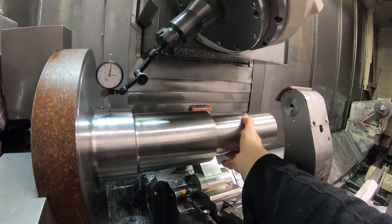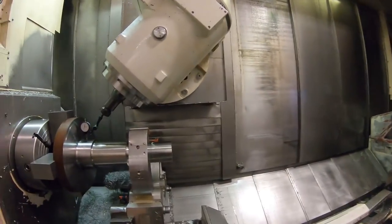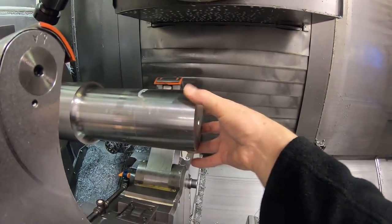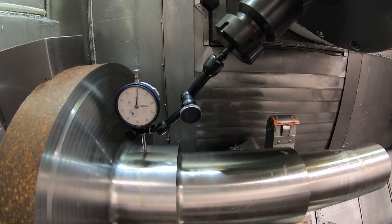And then I close the steady rest on the diameter because I have like an eighth of an inch. I don't know where my calipers are, but this comes down to four inches and it's already got like four and a quarter. I've got an eighth of an inch of material all the way down here to come off. Let me see if I can demonstrate this here.